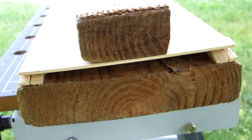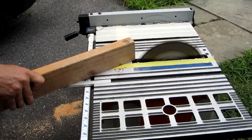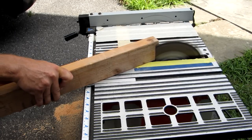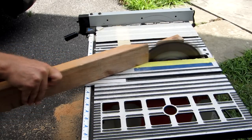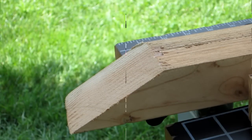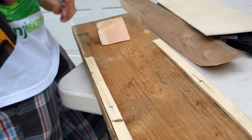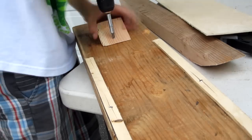This shot shows how the concave press works. If you want your cruiser to have a kick tail, cut an angle of about 20 degrees on the board you will use to press your cruiser. You will want to file this sharp angle so the wood doesn't break while pressing. You could also use a belt sander, which will make it much easier. Take the wedge created when you cut the 20 degree angle and attach it to the press with a screw. Make sure the end of the wood you will use for your cruiser lines up with the back of the wedge.